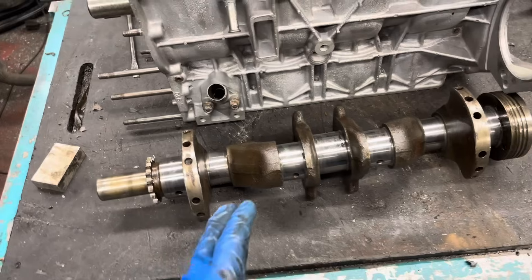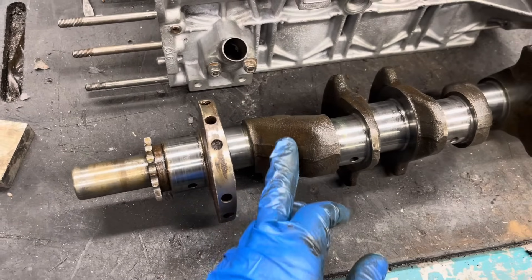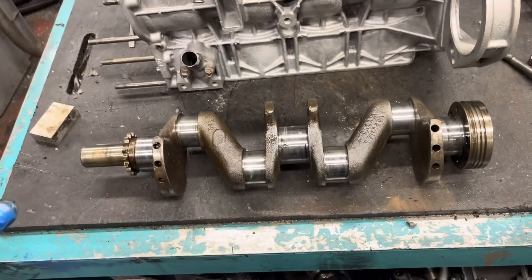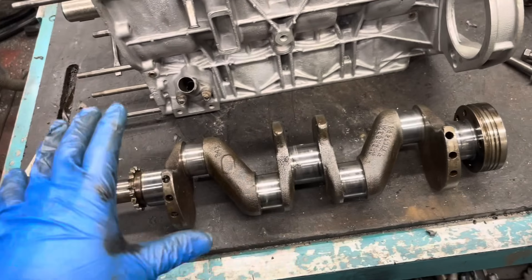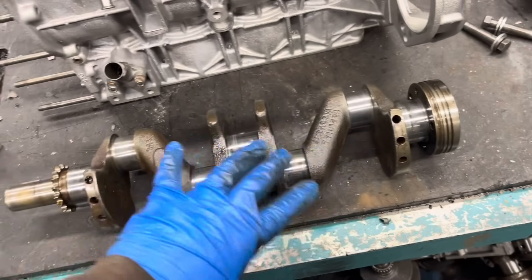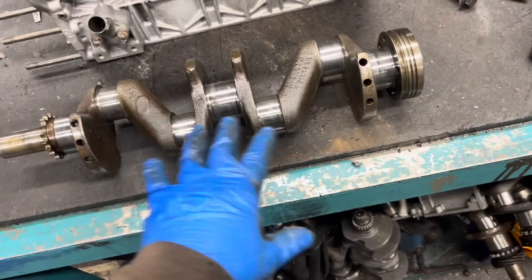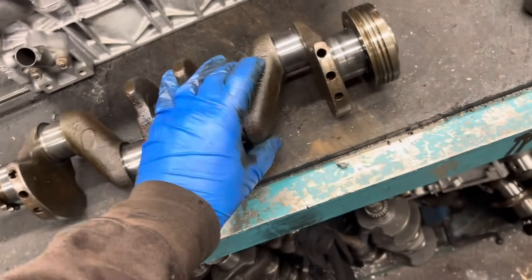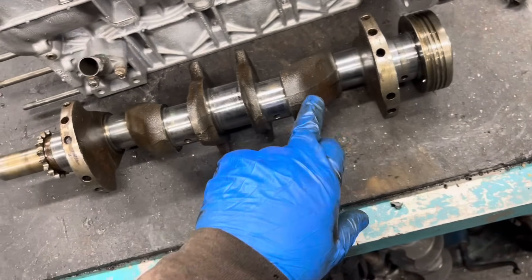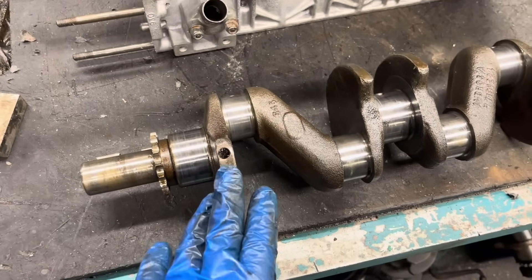It's made out of fairly good spec material — EN8. If this were a cast crankshaft we wouldn't have this forging line. In the factory they would have taken a big slug of EN8 steel, glowing bright red, put it in the forging die — which is basically the shape of the crankshaft but rough — and stamped it out under tons of pressure, thumping it until it forms a shape. The two dies come within a certain distance of each other, allowing excess material to spread out, leaving these big fat lines where the excess material has been ground off.